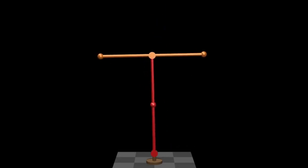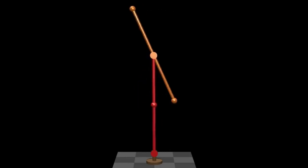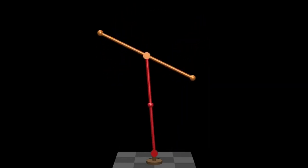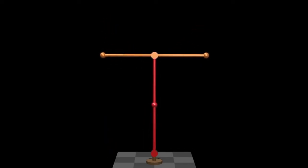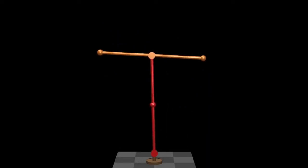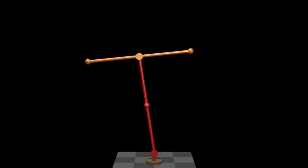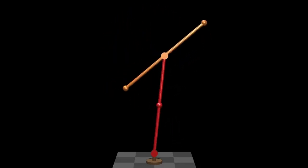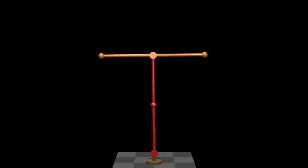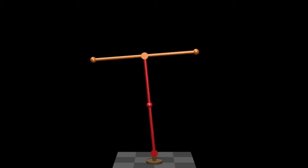When the robot leans in anticipation, it improves the tracking accuracy of the controller. This robot executes one sequence of motion commands without leaning in anticipation and then another with it. The first sequence without leaning in anticipation starts now. The second sequence with leaning in anticipation starts now, and you can see the robot starting to fall just before each movement.